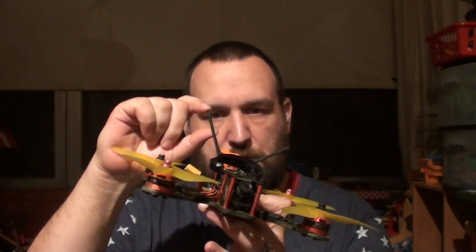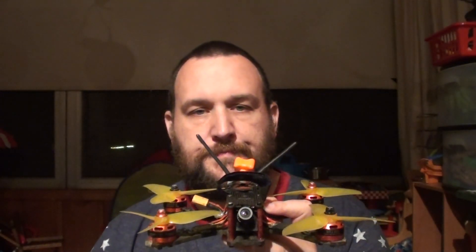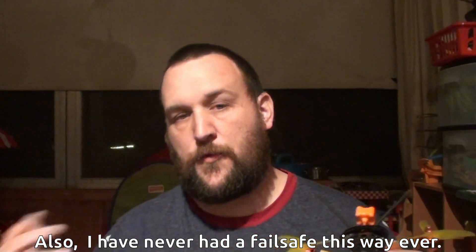The reason why I have my antennas long — I've had them shorter. My thinking was that if I made them really short, they're less likely to get hit by the props. But the problem I found, even flying in close proximity, is I would lose my telemetry once in a while. I updated the X4R to the latest firmware to solve that problem, but that wasn't the issue. I kept having dropouts on the telemetry. Did I lose control of my quad? No. But my telemetry would drop out during certain maneuvers. So I got the business end of these antennas — the very top portion — away from the quadcopter, and now I almost never lose telemetry. I have to be far away to lose telemetry. I guess Joshua Bardwell has evolved his antennas to where he's at now — I've done the same thing.